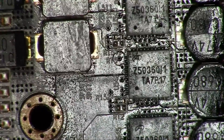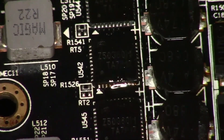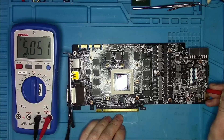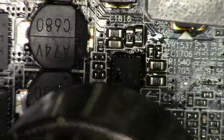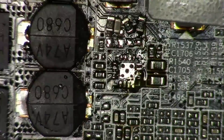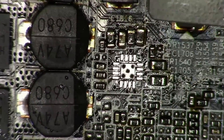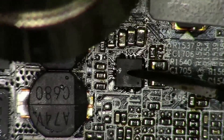Once cleaned up, I will inspect the soldered pins — and this one I don't like, so I'll quickly go over it to make it look like it came from a factory. Recheck the measurements, and the short is gone, and even the 5V rail is now showing several kilohms. All is looking very promising, but remember this controller was part of the short circuit. I decided to replace it as well, just to be sure we don't have any problems later. As I was removing it, I accidentally knocked off 4 components, which I thought I had positioned correctly. Taking a quick look at the donor board, I had to quickly rotate a couple of them to avoid any potential disasters. The lesson here is: either take detailed pictures of the board, or have a donor sitting around for comparison.